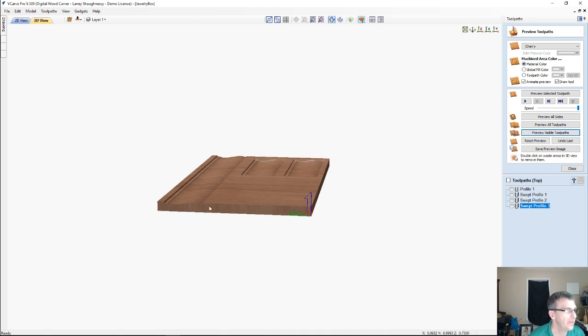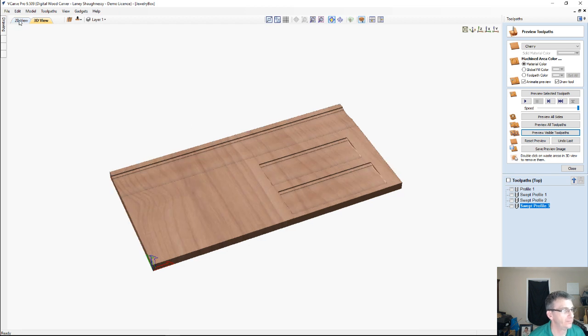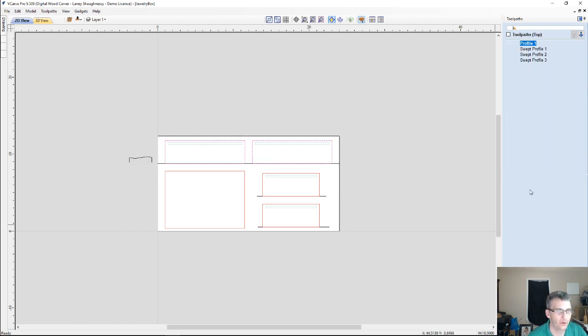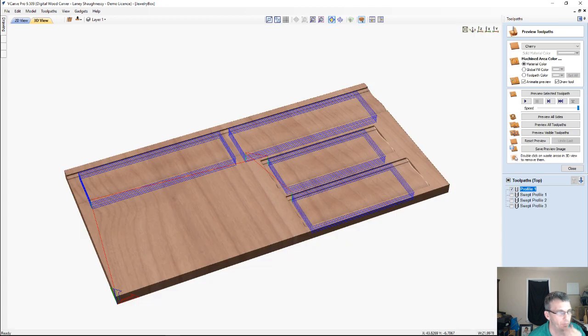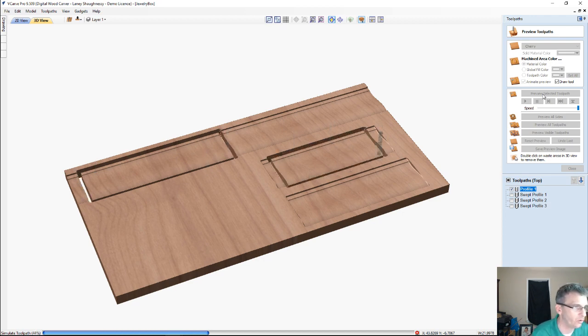All right. And so we've got our profiles there, or I'm sorry, our swept profiles, our molding shape. And if we took our parts here, I'm just going to open up the profile toolpath and add these 2 guys into it because they're all the same, and just calculate that toolpath. And therefore, if we previewed that toolpath and we cut out the parts, we would have our front, back, top, and side for a nice contoured box.